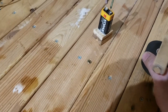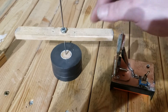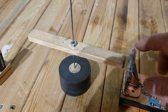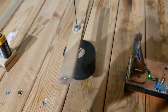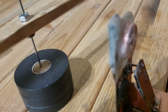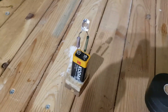I'll give a little demonstration — we just have to line everything up. As it comes around, it will actually switch the reed switch in here and put out a magnetic field across the coil, and that'll push it around. We'll just switch on and we're off already — if you listen carefully you can actually hear the reed switch switching.